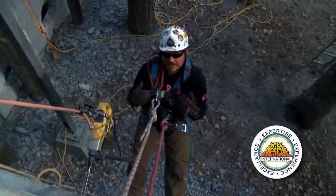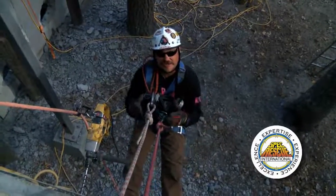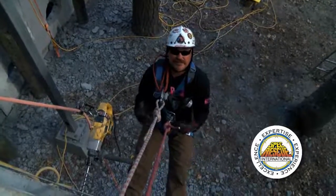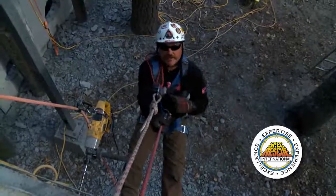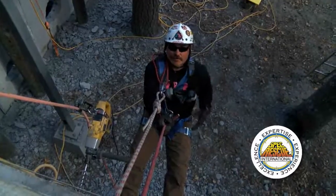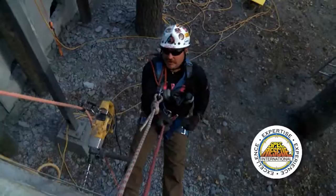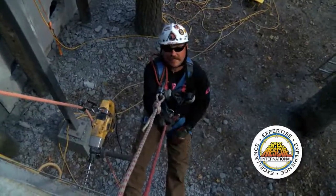As you can imagine, if you're doing a rescue you're going to be in a hurry — you make that rescue and get down. Sitting in the harness for five to ten minutes gets fairly uncomfortable, as you can see — it's starting to wear on me in the hips. One thing you could do is drop the harness down a little more on your rear to get more comfortable. If you're going to be doing hammer drilling on the side of a wall for a while, I would recommend a bosun's chair — it would make life a lot easier.